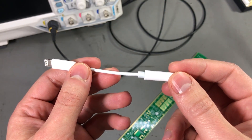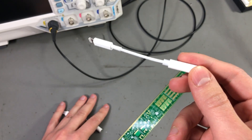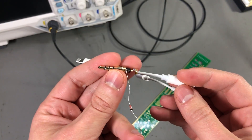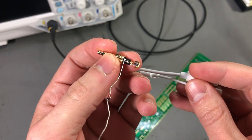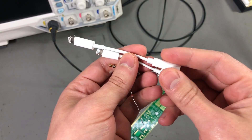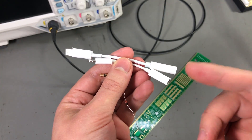This made me want to take a closer look. So here are the two adapters. The plan is to connect a 3.5mm jack to the adapters — it has contacts where I can probe with the oscilloscope — and I'm going to generate a known constant waveform from an app on the phone and measure that to compare between these two adapters.